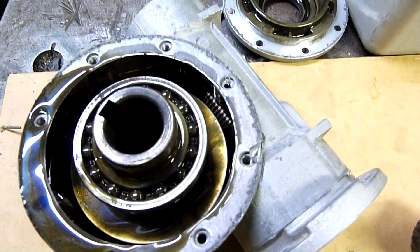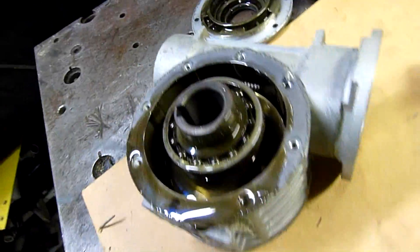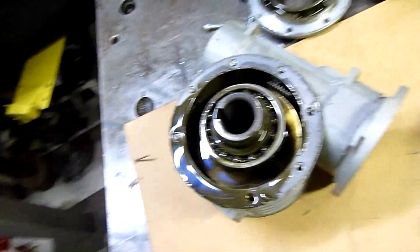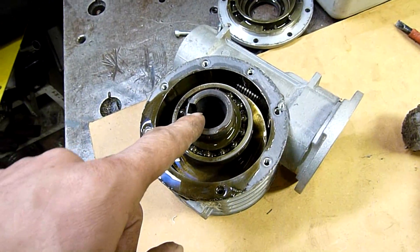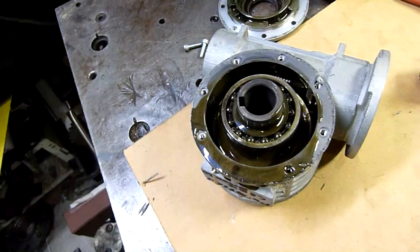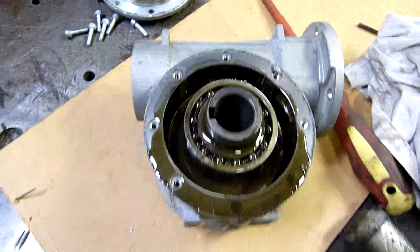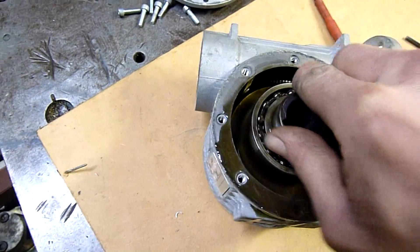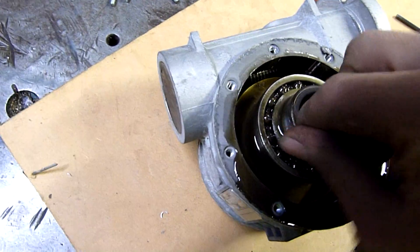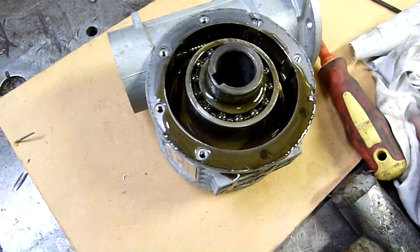Not going to be able to turn that — looks like it's wedged in there fairly firmly and it has popped back. It's going to go that way a little bit more, but since the bearings have been eating bronze filings at 2000 RPM they're not going to be very happy. This might only be spinning at 100 to 1 ratio on the output, but the input is spinning at motor speed which is about 2000 revs. So it's been eating itself for a while. You can see there's clearly a dead zone where it's stripped all the teeth off. The bearing is locked up with chips and it's actually turning in the housing.